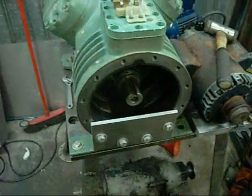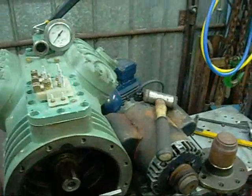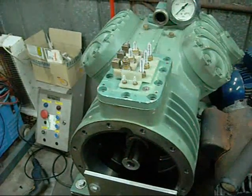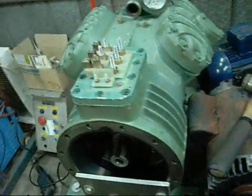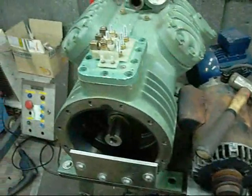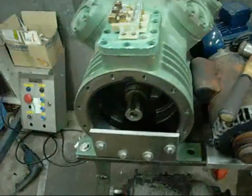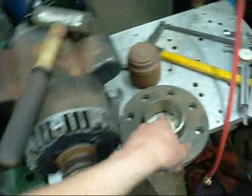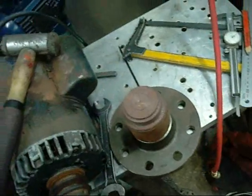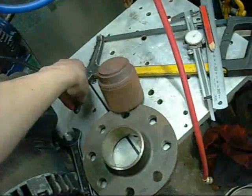It might be a little while before I get this thing running under proper power. I found out today the lump of tool steel that I wanted to use really isn't good for welding. I could probably weld it but the welds would end up cracking because it's just so susceptible to hardening that it becomes brittle. Under a bit of stress the welds around the flange would just start to crack and eventually come loose. So I'm just going to get some more mild steel and make an adapter sleeve out of that. I want a single piece sleeve with the flange welded onto it, with the inside turned to fit the 42mm shaft. I even found an electrode for the EDM so I can just EDM a keyslot in it — a blind keyslot.